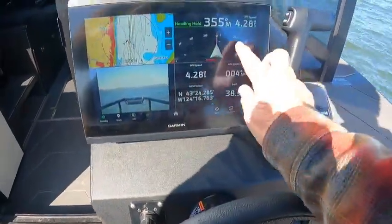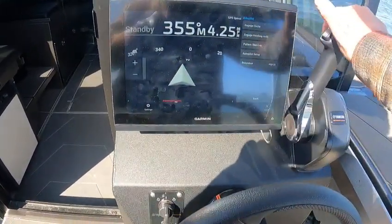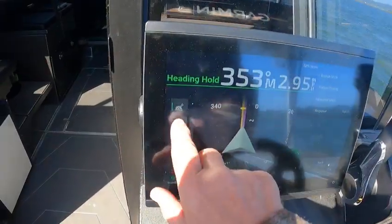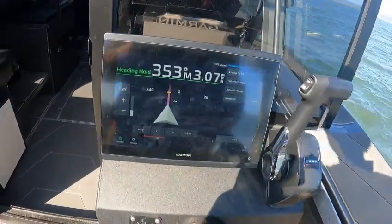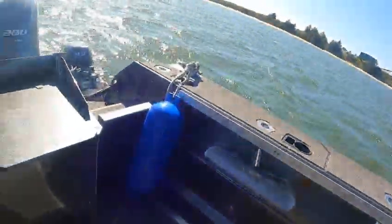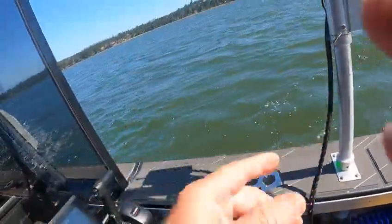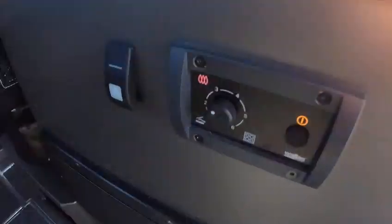I can make this screen bigger, put it on standby, put that in gear, then hit engage again. Now it's engaged. To add speed I can do it from any one of those gauges up there. If I wanted to do a circle, I go to patterns, hit engage starboard, and it's going to do a circle. Sometimes to help it you can just turn the steering wheel on the main just a little bit. See how we're doing a circle now.